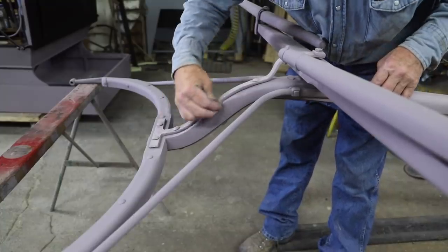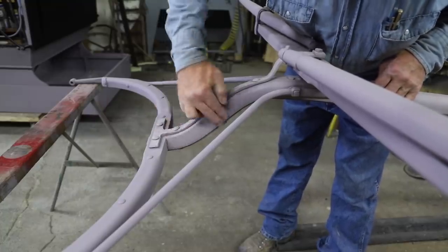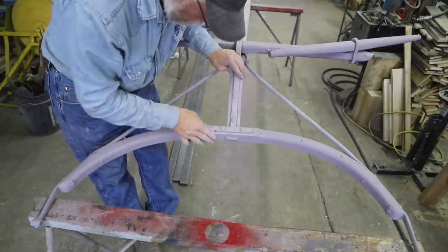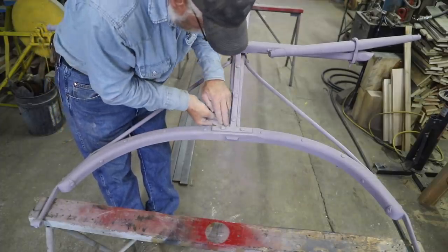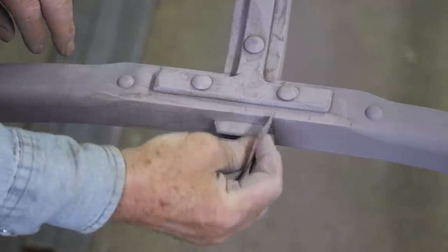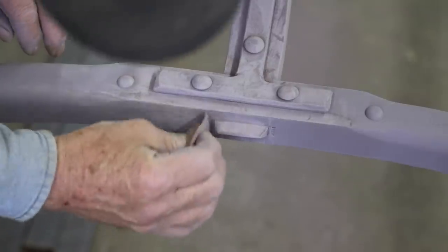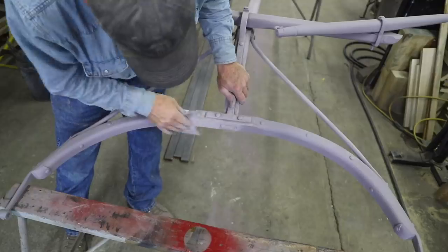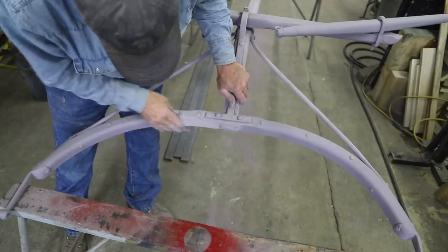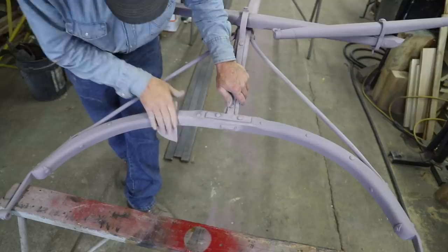There are some styles that are set individually and will swivel on a bolt instead of being all one piece. A common style, just like the double bend shafts, will use a double bend pole. As you watch me build this pole, you'll remember that the pole is a mortise and tenon joint as it attaches to the pole circle or the pole bow. Again, the tenon is left proud and tapered off — it's just purely a fashionable finishing touch. The circle or bow is what goes out to the eyes on each side where it will attach to the buggy axle itself.